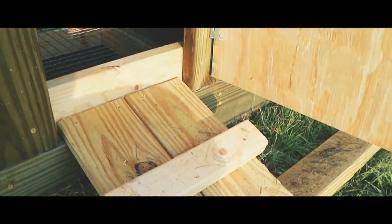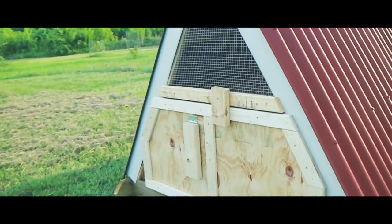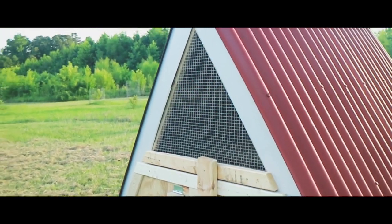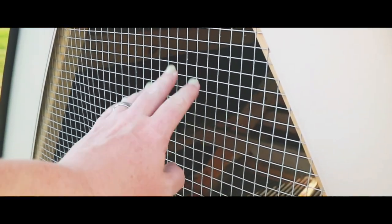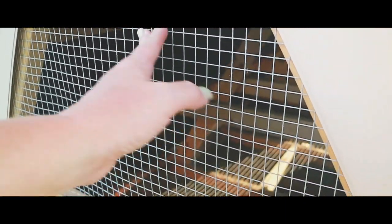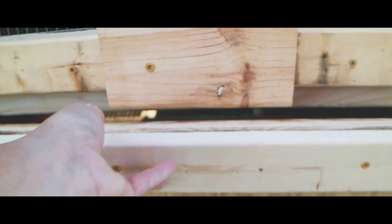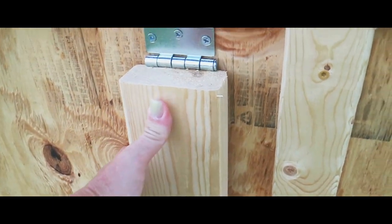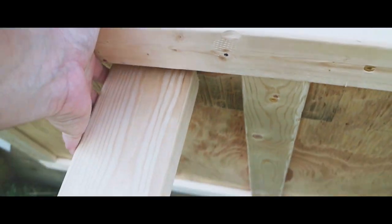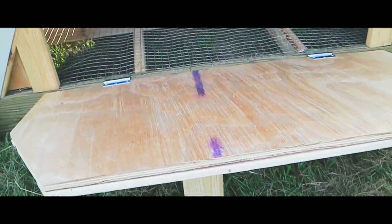That's how it opens up. The chickens can go up inside there — that's their roosts. Over on the other end here we finished up the door. I don't know if I'm going to make a shutter for this. I might just leave it as it is because airflow is important even in the wintertime, and because their roosts are at the other end, I think this will be fine. The big door here we also put a wood swivel latch, and right here I added a leg that hinges out so that it can support the door when the door is open. That way it doesn't put any stress on the hinges.